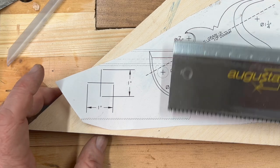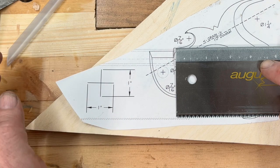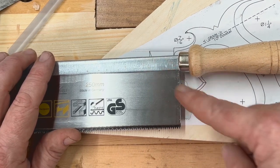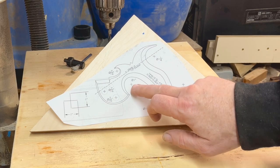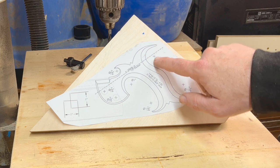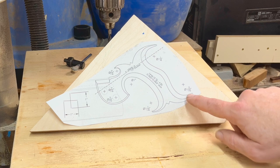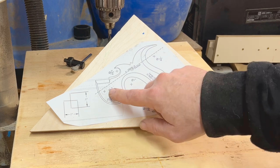I chose a 10-inch dovetail saw template and it's pretty much exactly right on the measurements. Now, the little plus signs on the template next to the numbers indicate drill positions. We've got an inch and a quarter, one inch, an inch and a sixteenth, an inch and seven sixteenths, and seven sixteenths. Each one tells you exactly where the curve center points are.